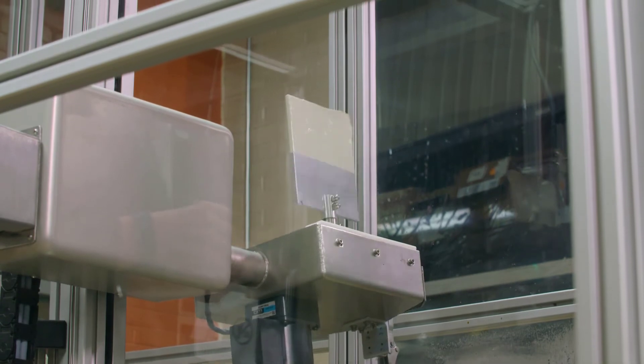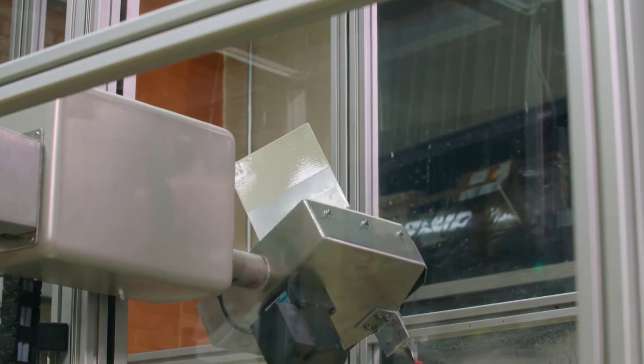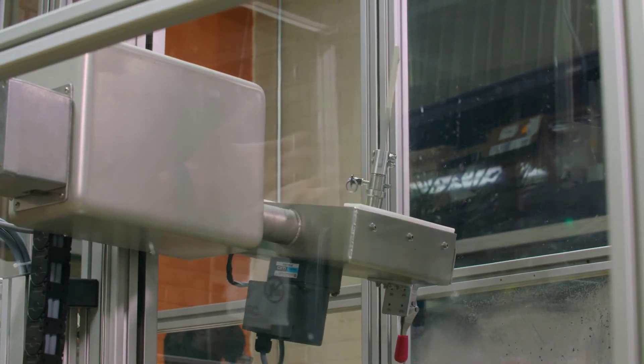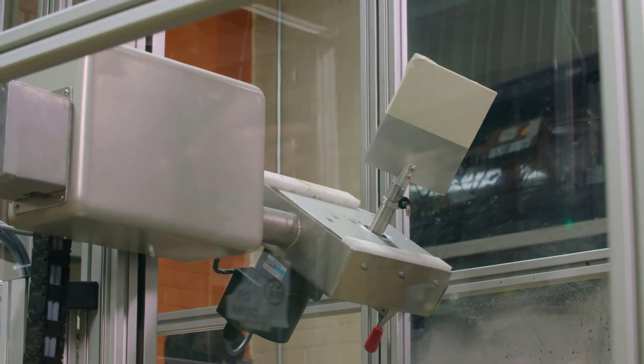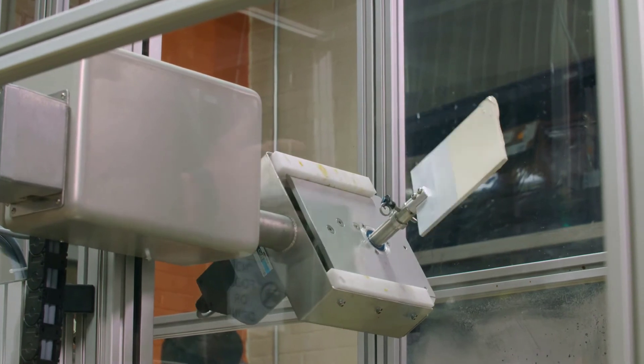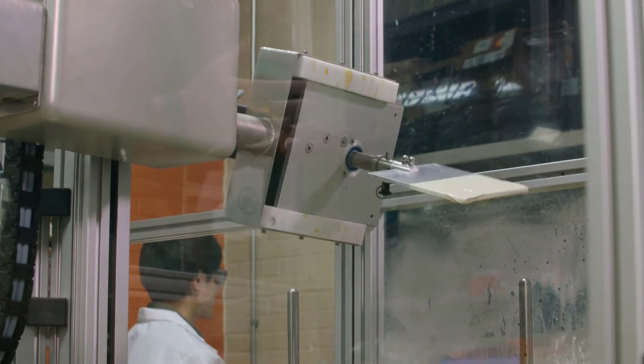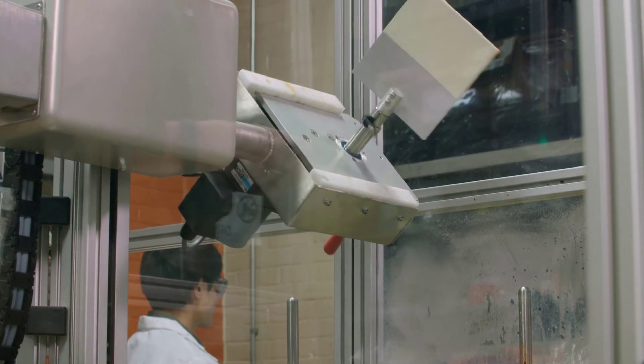After this film has set up, it would go into a curing oven — so it would be baked for a little bit. Then it could come back out and have a polymer coating applied, or be leached in that less-than-finished stage. It would then go back into the oven to be completely cured, and then it would be as strong as the glove you get out of your box.